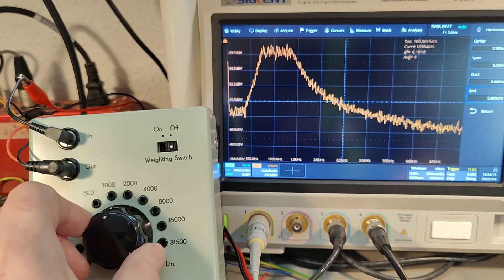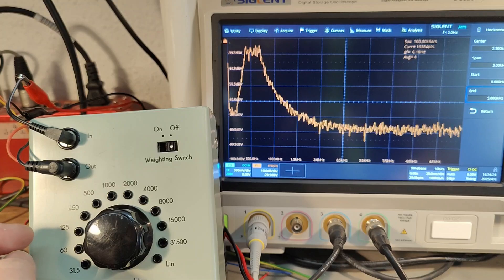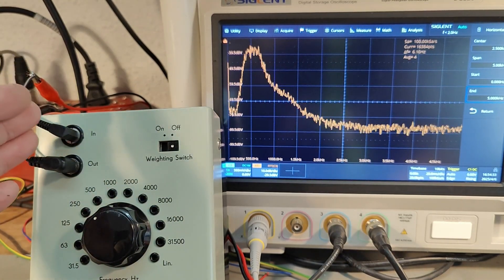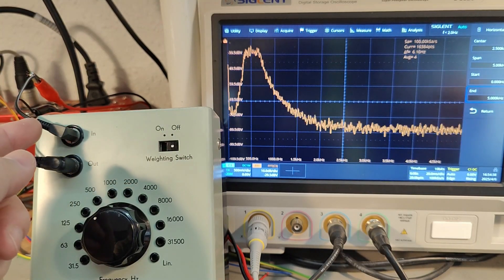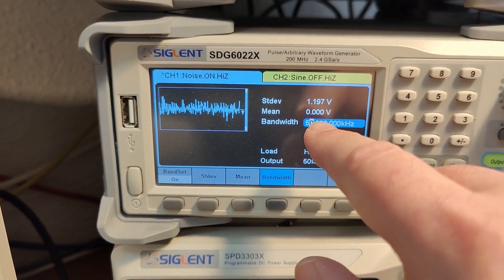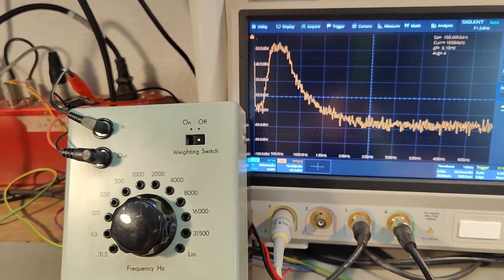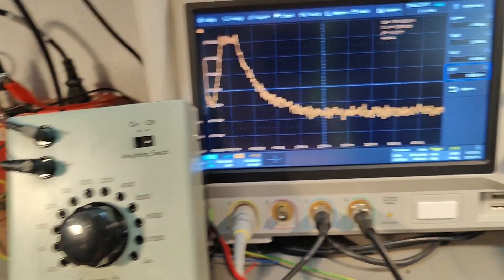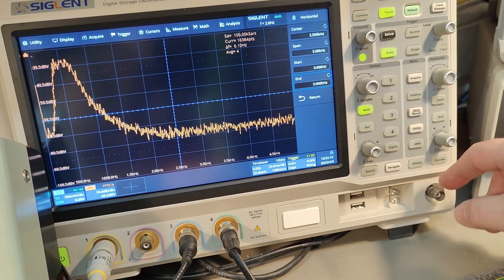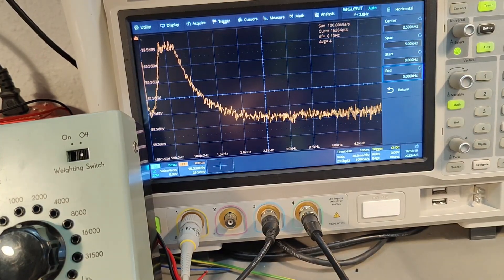Well, that's 500 Hz, and all the different ranges work perfectly fine for this one. I'm inputting a broadband noise source as my input from a signal generator, and I also set the bandwidth of the noise to 50 kHz. If you set this to 500 MHz or something crazy, then the energy level you will have left in this wanted frequency band will be close to zero. That is why this internal signal generator is completely useless for this because there is no way to change the bandwidth. When you enable its noise modes, it's just from zero to 500 MHz, and then there is nothing left but just some crazy background noise.